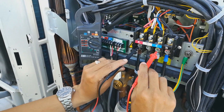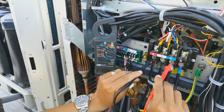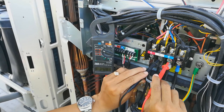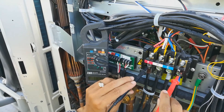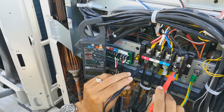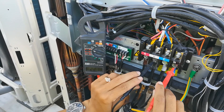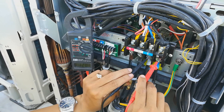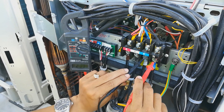We need to make sure there is enough power supply — 380 volts from phase to phase: A-B, A-C, and B-C all should read 380 volts. Then we check from A to N, B to N, and C to N to make sure there is 220 volts supply from phase to neutral.